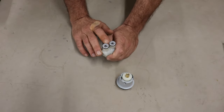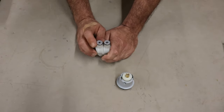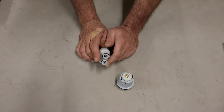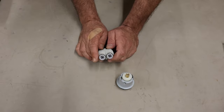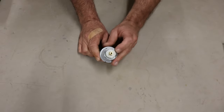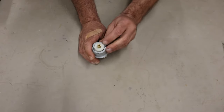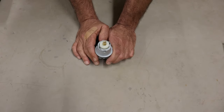On the back ends of the cartridge there is a little check valve — it's like a small mushroom flap that's pushed open by pressure and slams shut if water tries to flow back, acting as backflow prevention. Most faucets have these backflow preventers nowadays. These valves also have a scald guard — on the Delta it's easy: you pull it, turn it, and set it hotter or colder.